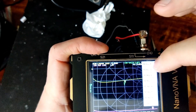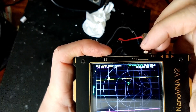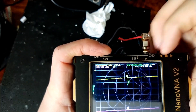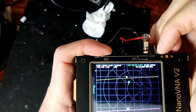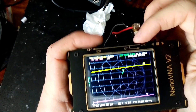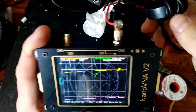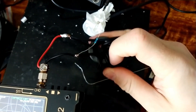We'll recall number one. Given the way these transformers are acting, I'm almost suspecting this is actually L15, not type 43. At 18 MHz, 21 MHz - 15 meters is about 1.5 to 1. At 10 meters we're still at 1.8 to 1. The transformer is very broadband. I suspect I've got a little bit too many windings because of 10 meters, but that's kind of the trade-off you make with how many turns you put around this core.